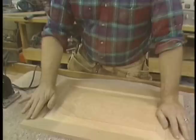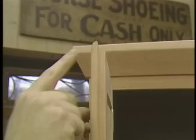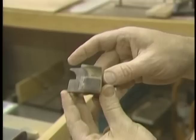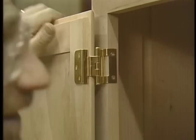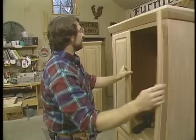I've removed my doors from the clamps, and I've sanded the joint smooth because there's one more milling operation I have to do with the shaper: making the rabbet and the round-over on the face side of the door. To do that, I use another cutter that does both operations in one cut — it cuts the round-over on the face and the rabbet. This happens to be a clockwise rotating bit, so I've switched the motor so that it'll turn in the right direction, and I'll be feeding from left to right rather than right to left. That takes care of hanging the doors. All I used was a semi-concealed casework hinge, and I'm in no hurry to apply those shelf standards — I'll wait till after the finish is on. Even at this point, I think it looks pretty good.